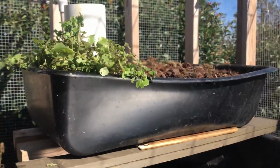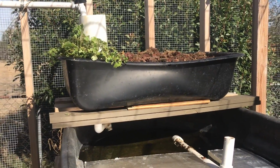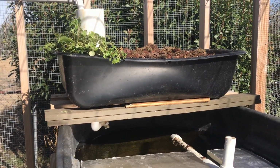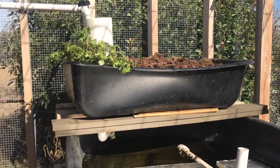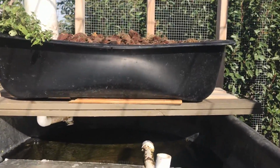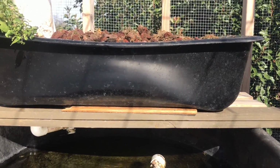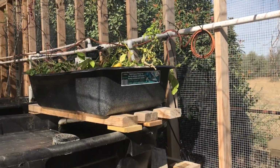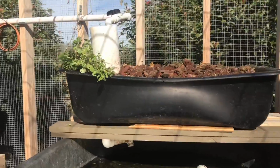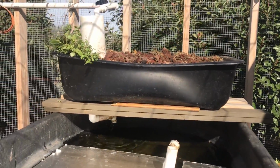One of the things I had considered was getting some marine grade plywood and basically cutting a base. And I realized something: 2x4s are stronger and they're cheaper. You can use pressure treated 2x4. A 2x4x12 seems to be the magic number for me, getting the best bang for the buck on board footage. With one of those, you could make enough for 2 of these over these bins, and they'll damn near last forever. You just put 3 and make a spot for them.